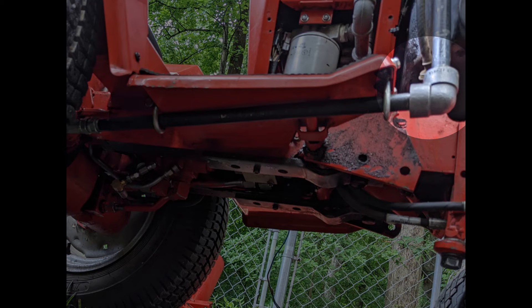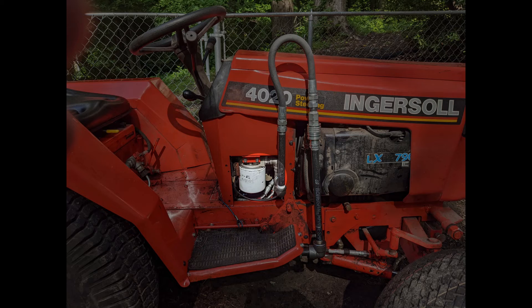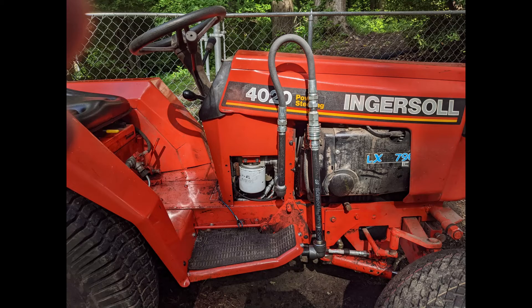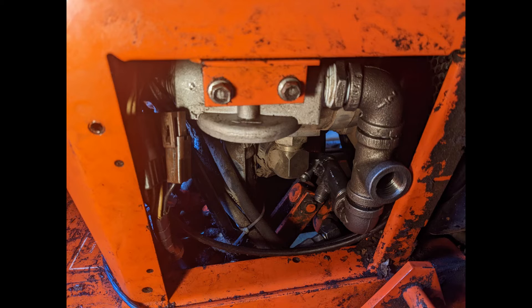The fittings, though, are special purpose 4,000 psi high carbon steel fittings. Note that standard iron pipe fittings must never be used in hydraulic pressure lines. Sticking out of the side of the steering tower is the corresponding return to tank line — also standard steel pipe connected into the oil filter at one end and with a permanently attached hydraulic hose at the other. Note that this line is strictly low pressure; the only possible resistance to flow is that of the oil filter and the oil cooler, which will produce a bit of back pressure, but never more than about 50 psi. Due to the low pressure, this return line can utilize standard black iron pipe fittings, which are rated for about 300 psi.